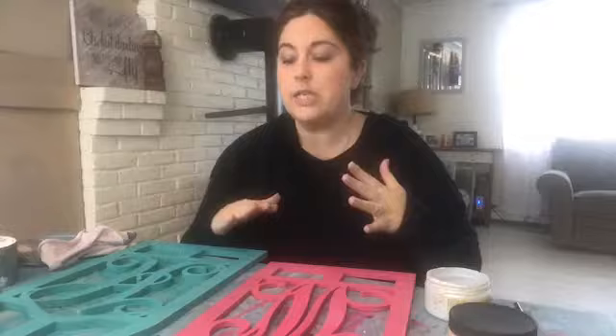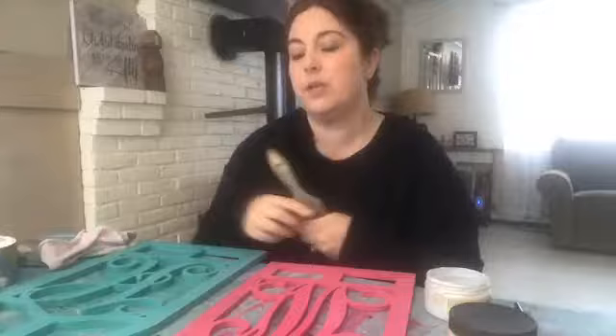With wax, you can apply it with a cloth — like with your finger — and if you're going to use a cloth, use something that's lint free and thin so you can manipulate where it's going. If it's a thicker cloth it's going to be harder to control where the wax is going. You can also use a chip brush to feather wax on all over, or if you want something to look really waxed and grungy, you could rub it all over. I like the glaze if I want something all over because it's a little less streaky.